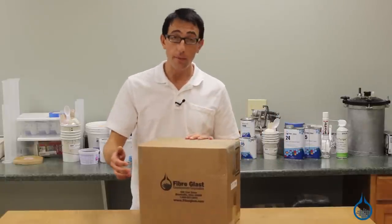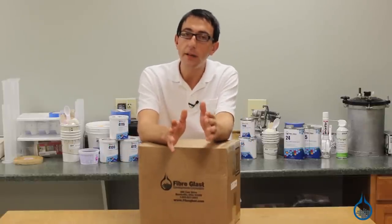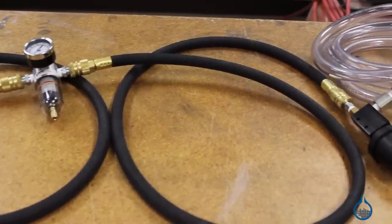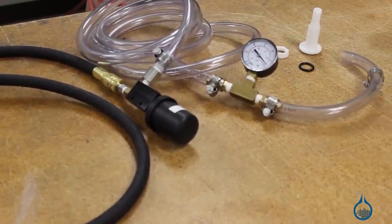Today we're going to show you our number 2227 vacuum bagging starter kit that we carry on fiberglast.com. Our vacuum bagging starter kit comes with everything you need to set up a complete vacuum bagging station and get started vacuum bagging composite parts. You just need an air pressure source capable of providing between 30 and 75 psi at 1.6 CFM.